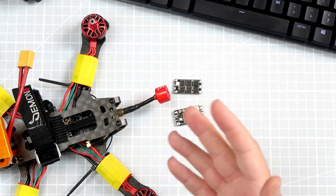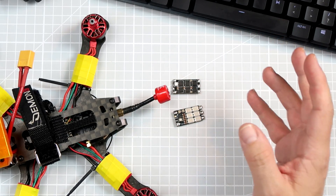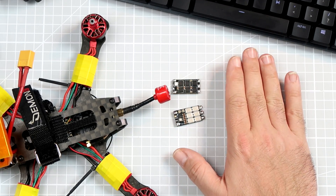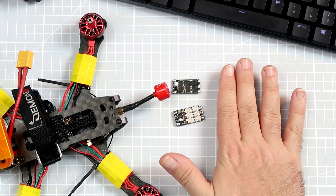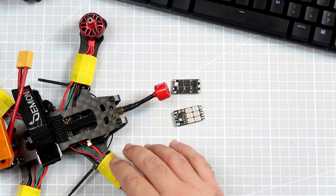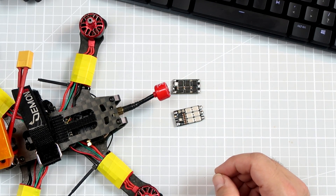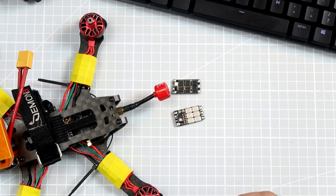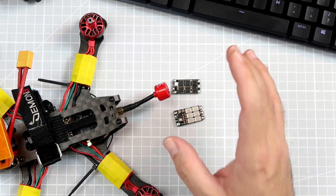From the hardware point of view, this is all. It can be four ESCs, three, two, or one. It doesn't matter. It can be a drone or an airplane — it will just work. When you do the wiring, try keeping it tidy because it runs close to high-current wires. There's a lot of electrical noise, and if the cable is overly long, that might cause problems. Consider using coax if you have a longer build like an airplane, or twist the wires to keep things tidy.